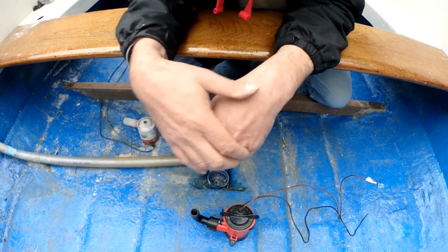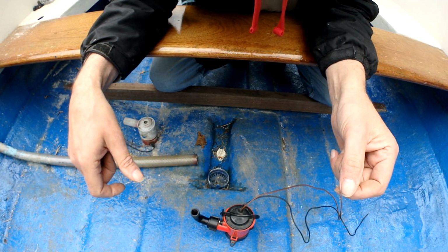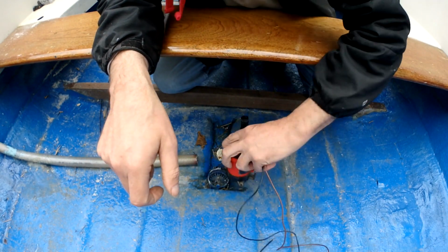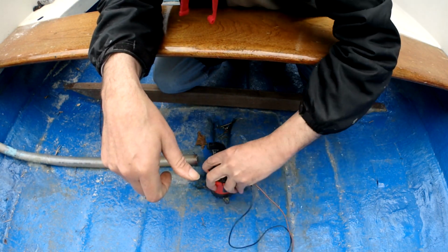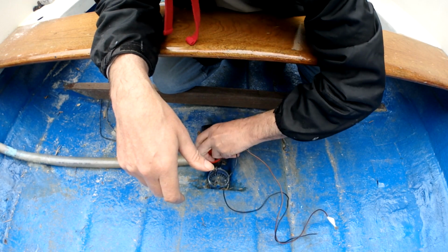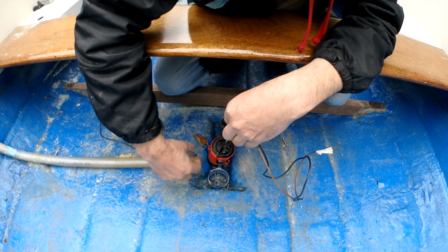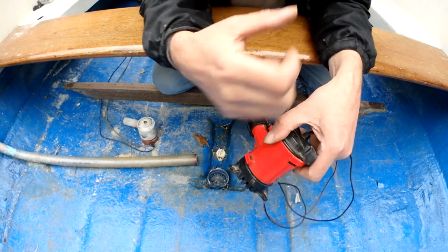There's a little tiny thing to catch the rainwater. Hopefully the water runs into it and not just lays on the boat everywhere else, where the pump can't get it. And the idea here is we're going to use this one, because this is a much better pump as far as I'm concerned, or not necessarily this one, but one like it. And we're going to have to chop off two of these. Now there's two screws in there. One of them will seal up, the other one we're going to put through the hole here. That will obviously go to a pipe, which will be under the seat. That'll be bolted somewhere there. Although that does still come a little bit this way out, it'll be better for when we box this in, because this has got to be boxed in, and the box probably is going to have a stainless grill around the base of it to stop any larger bits that might try and go into the pump, because we don't want that going in the pump.